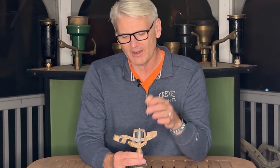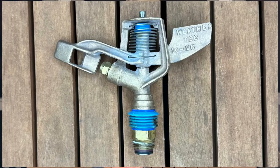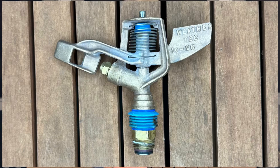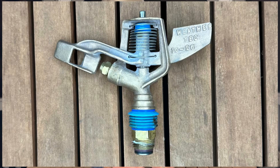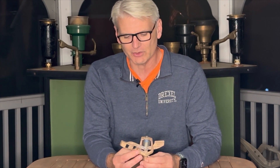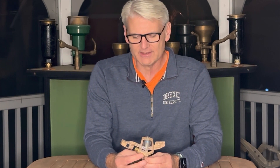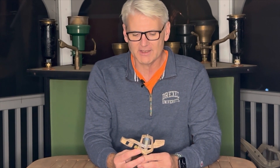This is the 1026 — a half-inch full circle single nozzle impact sprinkler. Its features include I-beam construction of the lever arm, a stainless steel fulcrum pin, stainless steel spring, and the spindle is stainless steel as well. Weather Tech mentions that the water port — the water tube that the nozzle threads into — is longer than the 1020, and that really becomes the distinguishing feature between this and their standard half-inch impact.